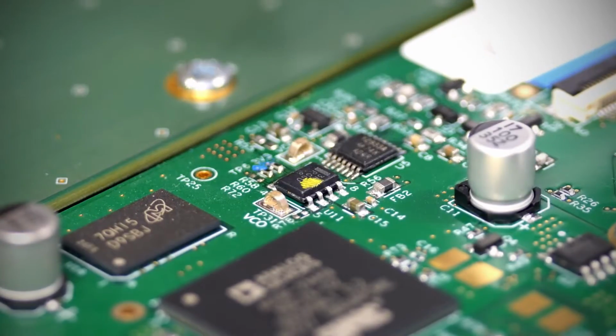And so those are multiples of 44.1. There's also multiples of 48. So 48, 96, 192 are two completely unrelated frequencies. And as typical, most interfaces on the market today use a single crystal to derive all those clocks from. And we use two crystals so that we get a really even and very clean multiplication path from 44.1 to 88.2 and so forth. And we're not telling the crystal, okay, you've got to do this tricky math to get from 48 to 44.1. So we have incredibly low jitter in all of our sample rates.